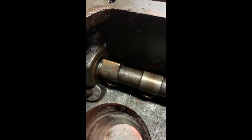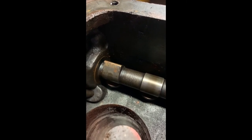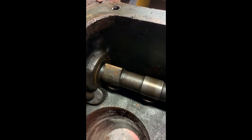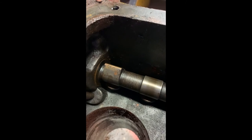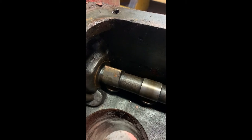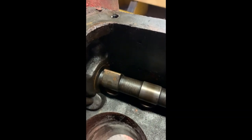This can be explained by considering the Hertzian contact pressure and the film thickness as a function of the cam angle. I'll make sure to put up a Hertzian contact pressure chart after this. The large particles that pits produce are caught in the oil filter or settle at the bottom of the pan — inspection of the oil filter or the bottom of the pan may be adequate to detect the iron particles. Use a magnet to get a good sampling.